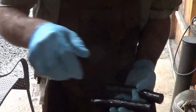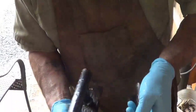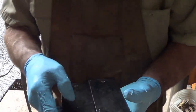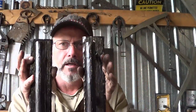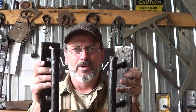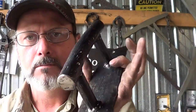And just like that — you get a nice darkened blackened steel without paint or without beeswax. So now once this is dried, I can go over it with poly or clear coat. Get her dried up, get her cleared up, and we'll be done. Used clear coat on these along with that blackening agent, and there you go — nice set of door pulls that look like tree branches. I had these branch pieces left over from the handrail project that you'll see probably next week once we do the installation. Not bad — it's kind of modern, you know, it's all welded, but everything was shaped and textured by hand on the forge. Very cool looking.